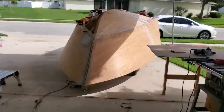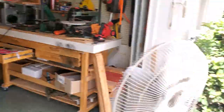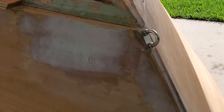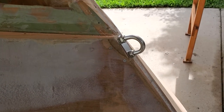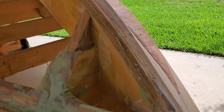So the boat build — let me just turn around here. There we are. We've got the fans blowing because it's summertime here in Florida. It's going to be a little bit of work today. What I wanted to show you is the breast hook. I just drilled in the breast hook. One of the most important things you can do is make sure that you get it centered and into the stem — onto the absolute strongest member of the boat, which in this case is my laminated stem. Good place for it.